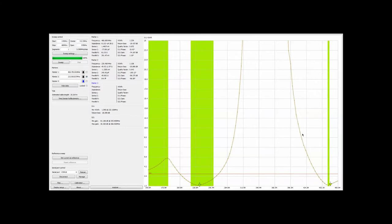Now you can see the change in the standing wave ratio. Again I'll direct your attention to the lower right-hand corner where we did get a marginal improvement — it went to 1.239. And on 235 MHz we saw probably even more of an improvement there. So the counterpoise is showing there is an improvement; it's not huge but it is there, and this will be shown in terms of the field testing where it improves signal quality from around 4x4 to about 5x5.